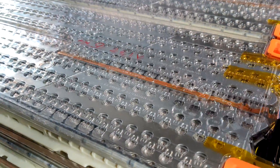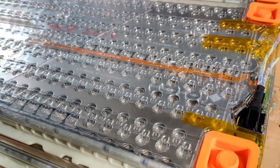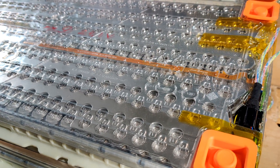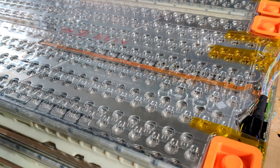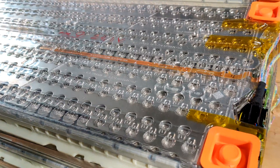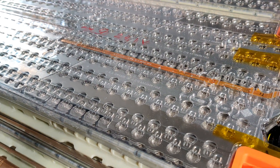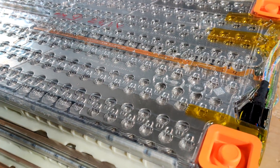If you're popping a bunch of these fuse wires, your voltage is going to go all over, and then more fuse wires are going to pop and it just goes downhill from there. Your module is essentially destroyed unless you want to do about — there are 450-ish cells — so about 900 spot welds.